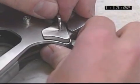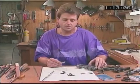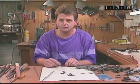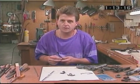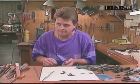Now it's in the place there. Is that clear, or is it still too much pressure? Still way too much pressure on it. You really don't want to be able to feel it going up. It's just got to be a perfect fit. I mean, it's got to slide up past you where you can't feel it, but it's also got to lay right on the part. Show us the wear mark.